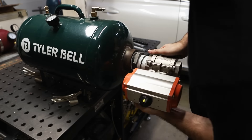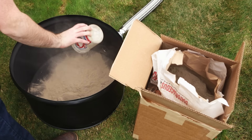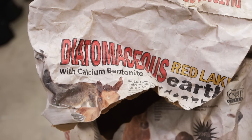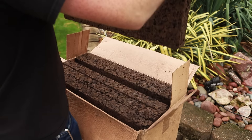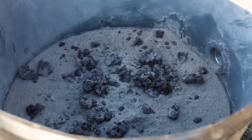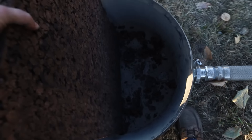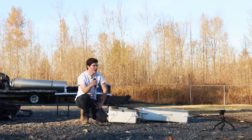Normally in movies when they need a dirt explosion, they use actual explosives and a little steel mortar filled with a bunch of dirt and cork for debris. Eventually I'll mess with explosives, but this time I just wanted to start out with something I was familiar with — compressed air. So in the spirit of this video using practical effects, I built an air mortar. It uses the air tank and valve left over from my Mark II air cannon, plumbed into an oil drum I cut down and welded a threaded bung to. I built this thing to eventually shoot tremendous fireballs, hence this great big bendy hose rated for 1,200 degrees Fahrenheit. This is movie dirt — it's anti-caking agent they put in animal feed, but it looks awesome dispersed in the air. I had 120 pounds of this stuff shipped to my house, along with some two-inch cork sheets you can break up to simulate rubble. I grabbed my jar of dirt, filled up the drum with a few quarts of it, added some cork, charged the air tank to 150 psi, and — well, it was very underwhelming at first, but I figured the oil drum was too big. I need more pressure and more dirt. So I improvised and added a ton more dirt and debris. Three, two, one. Oh, that was spectacular!